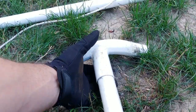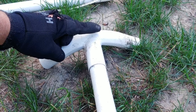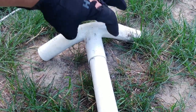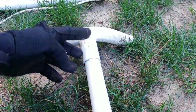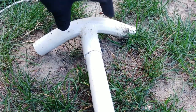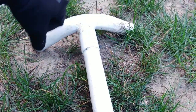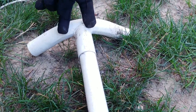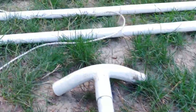And then I would put a plate on the end of this that stood up maybe like 3/8 of an inch above it and below it. And then I could drill four holes, two on top, two on bottom. And then the other piece that would butt up against it, I would weld a piece the same exact size as the plate that's on the side of this. It's the same four holes. And then I could just bolt them together. I could even go as far as welding the bolts to this piece right here. And then I could totally disassemble the thing if I wanted to.